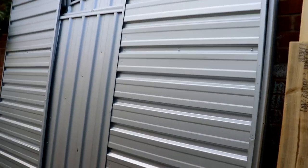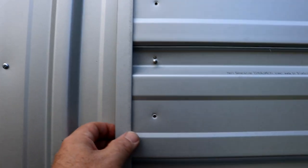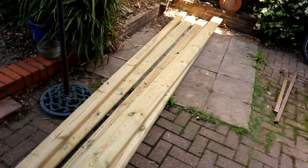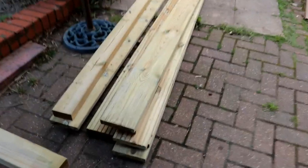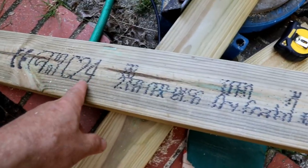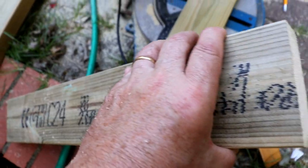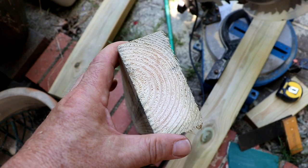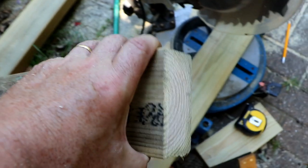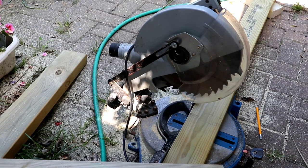It's a couple of days later and I've got the shed assembled. Interesting way of putting it together — with shaped edge parts and this corrugated, very good quality galvanised sheet, very thickly galvanised. So what I'm doing now is making the base. I decided to pay a bit more to get the proper C24 quality preserved timber, which is good enough for building structures — houses and things — because it's proper pressure treated. You can see how far it's been squeezed in under the pressure. I'm also going to paint the ends that I've sawn with some preservative.